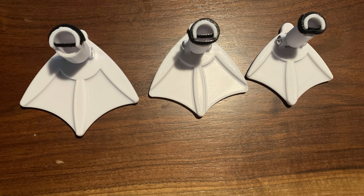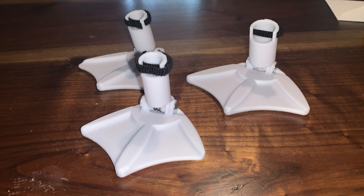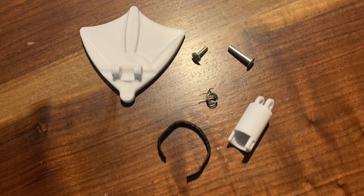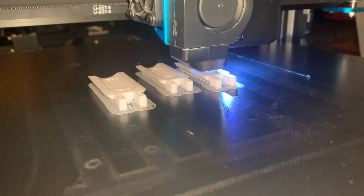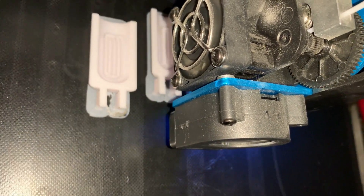For prototype number two, I hollowed out the center of the hinge section on the foot and increased the diameter of the shaft to strengthen the hinge and give the prosthetic a snug fit against the duck's leg. I also created three different sized feet and three different sized shafts to allow adjustments for duck growth, and made the hinge joint universal so all shafts can fit into all feet with the same pin mounting system. With the ability to print all three feet and all three shafts simultaneously on my Artillery Sidewinder 3D printer, it took less than a day to have three configurations completed.